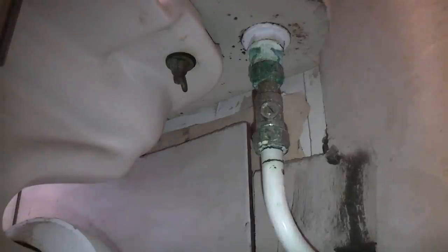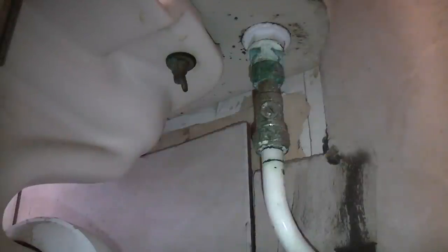The reason I've been putting this toilet off is because of the way the water inlet is configured. It bends right out of the wall — it's solid copper, painted — and then goes into a service valve which then goes to the water fill valve. There's not going to be a lot of movement in that, so we need to ensure that the new water fill valve we fit is the exact same length as the old one, otherwise we're going to have problems.